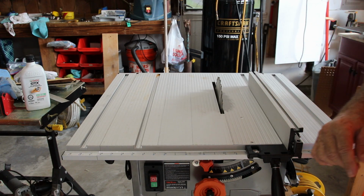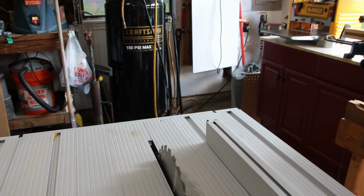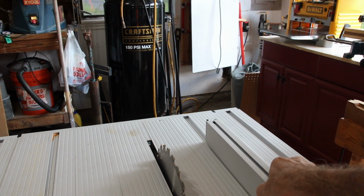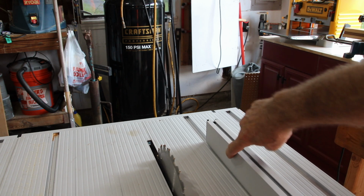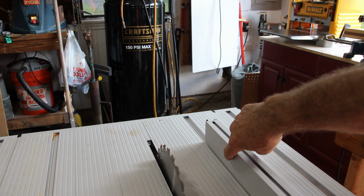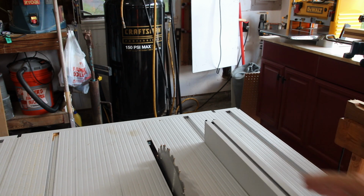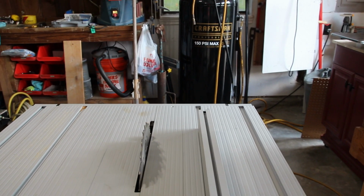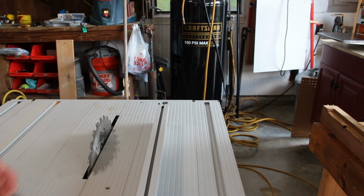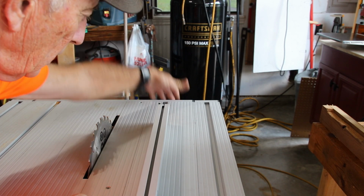Let's close in and take a good quick look at that. You see that little bit? I'm pushing with a finger, and I'm pushing pretty hard, but that's deflection. Look at this, that fence is moving around. So ideally, the only way we can get around this would probably be to extend this out, put a T back here and lock it.